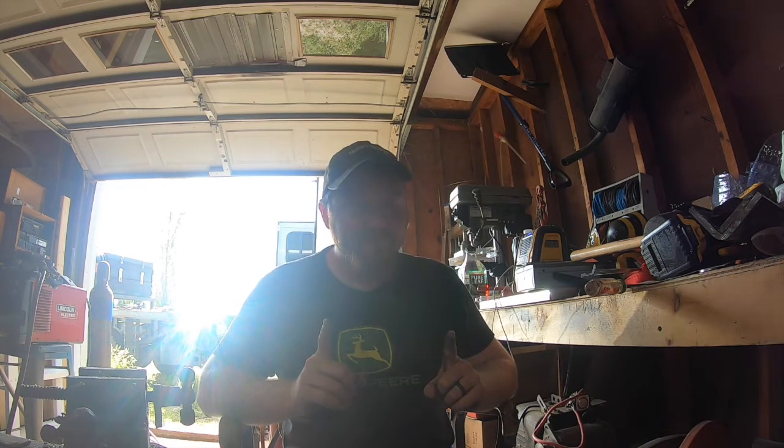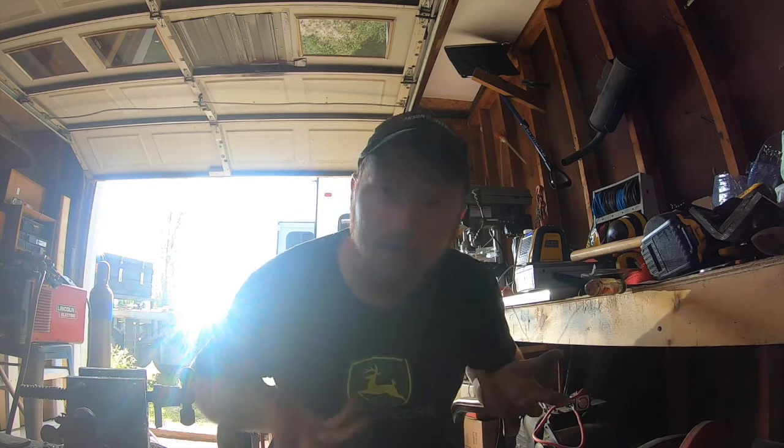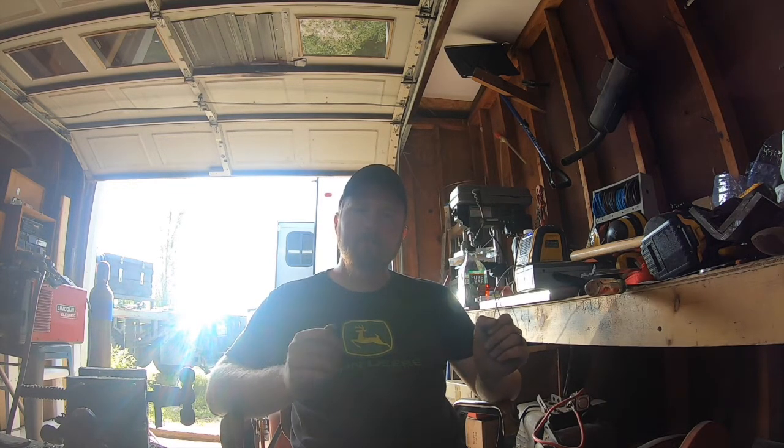What I did was I got 220 and I preheated the aluminum. I brought it up to about 500 degrees. That way I wasn't sitting waiting for that molten metal to move as much, and I could establish a puddle and just dab.